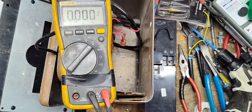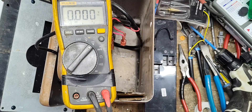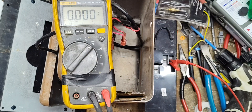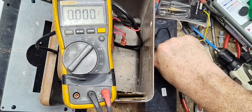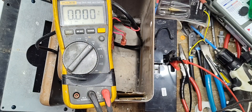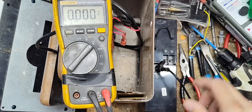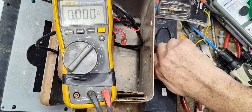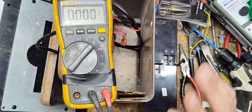I'm going to take a power supply, set it to 7 volts, and hook it across each battery individually to see how much load it draws. If it puts a good load on it... 0.2 amp draw - that battery's got a bad cell. Do the same over here - it should have a much higher draw. That one's 0.01 amps, even less. So the batteries are junk, that's definitely a problem.